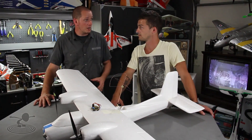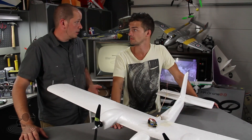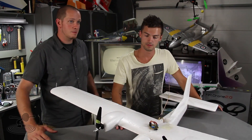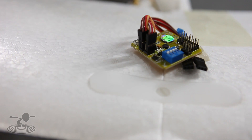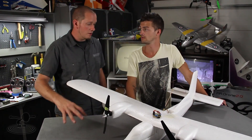It's a handy board because it has MEMS gyros in it, instead of the old-style gyros with a board sticking vertically. It's not just for airplanes — it's primarily for multi-rotors, but airplane pilots can use it too. On the Hobby King page under files you can see each switch position. You do need to do stick centering and ESC calibration on multi-rotors, but it's far easier than it used to be.